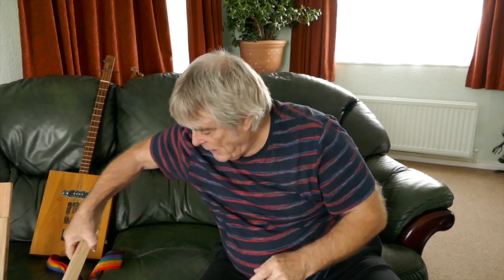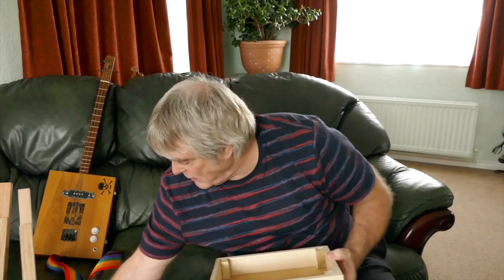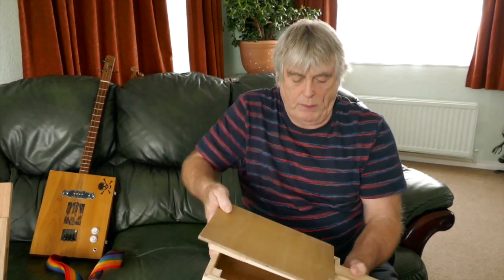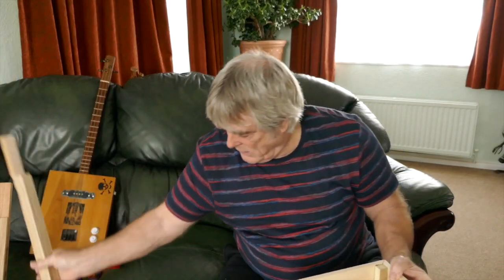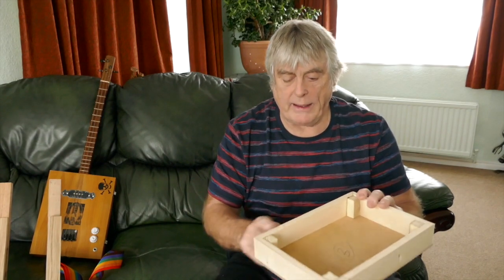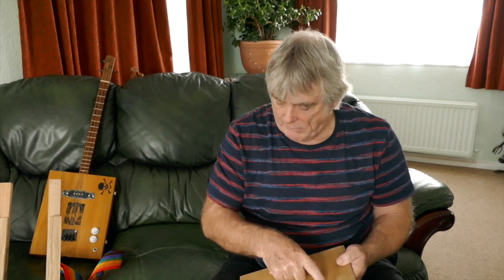If I haven't got boxes I will build my own, and here's a couple. These two boxes are actually for these guitars here - when it's cut out it will go in there, the lid goes on top, and that will be a guitar eventually. I just get some 5mm planed timber - I've actually got a planer so I buy sawn timber and cut it to the size I want. I put dowels in the corners so the lid is screwed in each corner. Then holes will be cut in it for tone, volume, and a pickup slot.